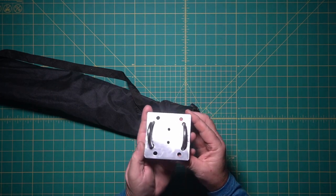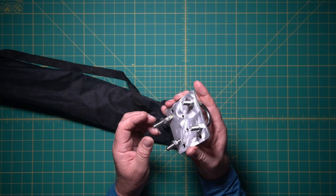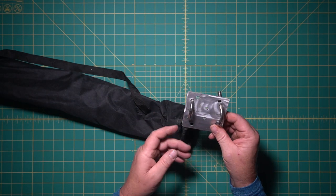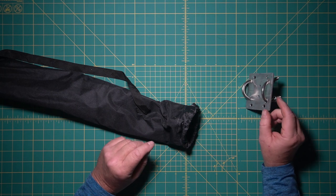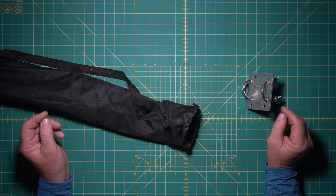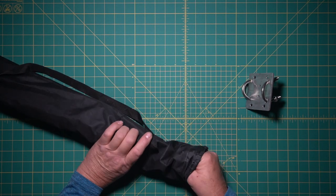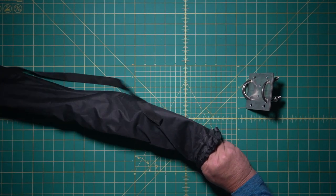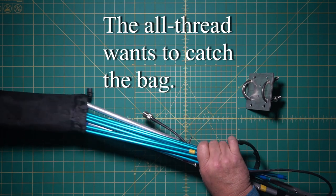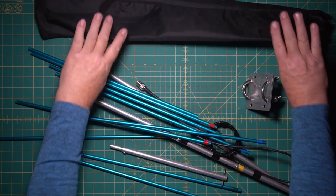Alright, this is the mounting bracket, kind of shiny, to the pole for the mount, to the pole that I put it on when I'm out portable. It could be anything really, it could be a fiberglass mast or a metal post. Now if you're going to do it vertical, you basically want to make sure there's nothing in the line of the elements. So you're probably better off to put a piece of PVC at the top of your pole to mount it to, unless you're using a fiberglass pole. Hardest part of getting these out basically is the, well, I'll show you in a second. There's all the parts.